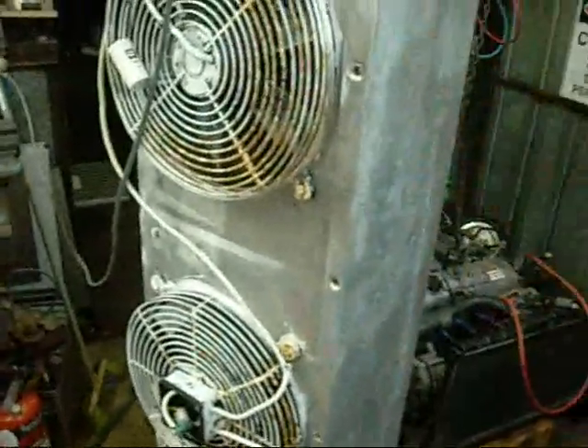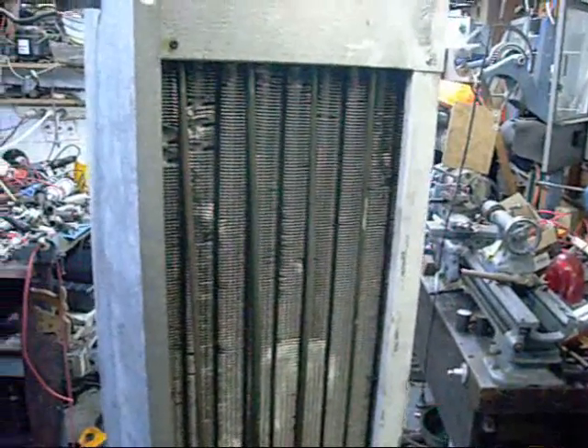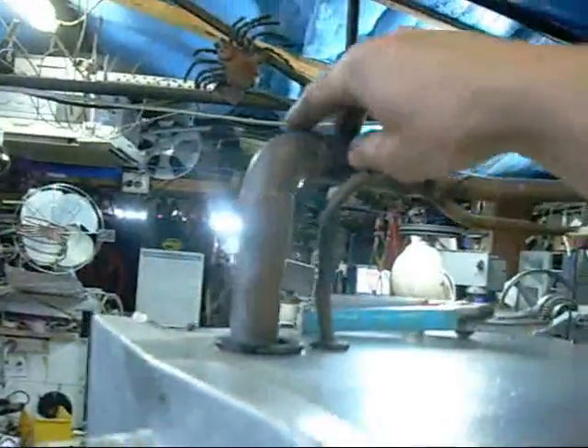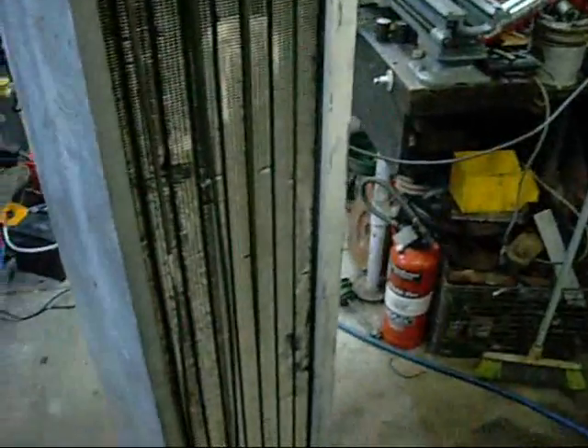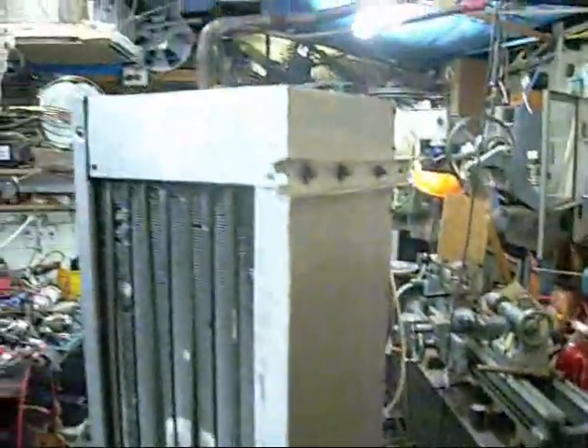So you want the most flow through the coil - that's what I really want to do with this big Buffalo Trident cool room evaporator. It's too old and banged up to be used as a cool room evaporator. I'll probably never have the horsepower here to actually run it like a semi-hermetic refrigeration unit - I don't have three phase power. I'd never be able to provide enough refrigerant to this system. Look at the size of that suction line - that's a one and a quarter inch suction line. No way I'll be able to supply enough refrigerant to it, so let's turn it hydronic or at least try. As I always say, there's no harm in trying. Beats just tearing it apart and throwing it in the steel bin.